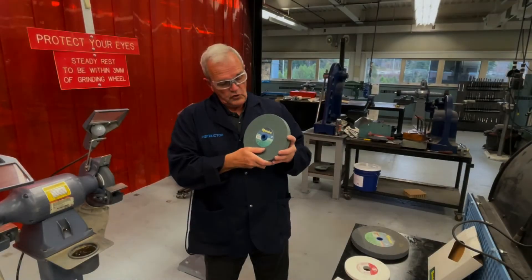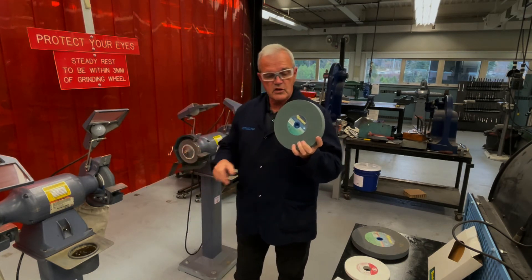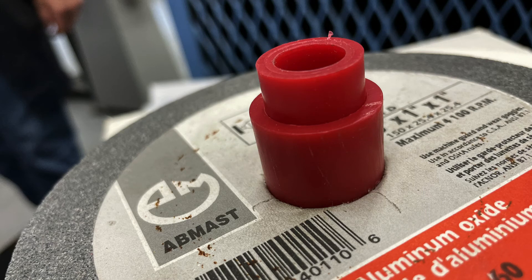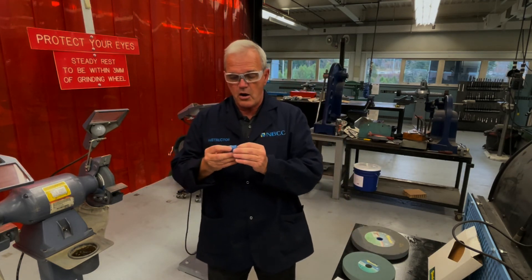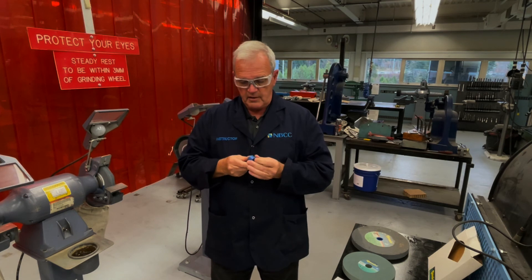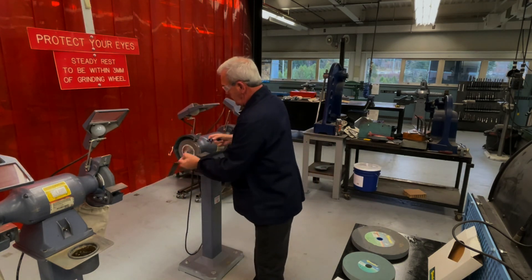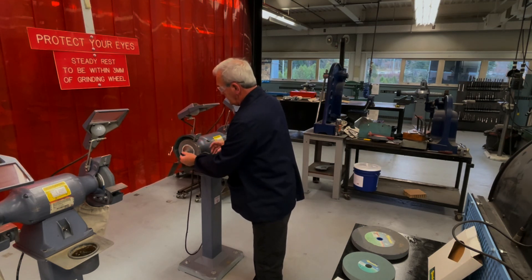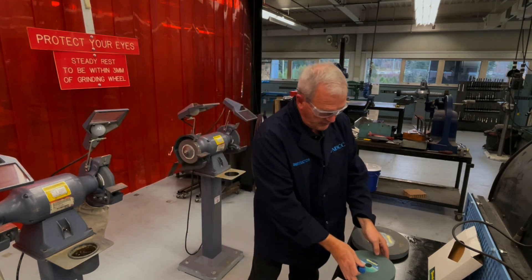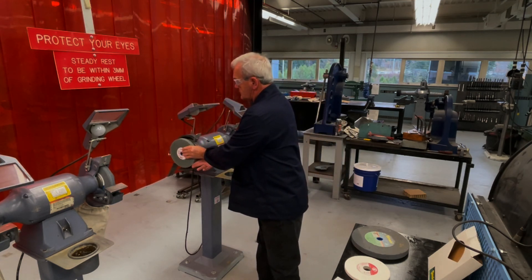You'll see I'm pushing out some little bushings. You have to make sure your stone is resting on the arbor — it's got to rest on the arbor and be tight. This particular grinding stone has a series of three bushings. I can slide them out and select the bushing that will fit the arbor I have available. There's the smallest size, the midpoint size, and the largest. In this case, the largest is too big, the midsize fits perfectly, and the smallest is too small. I discard the ones that don't fit, put the correct midsize bushing back in, pop them together, slide it back into the grinding stone, and now I'm ready to mount that grinding stone on the arbor and bolt it down.